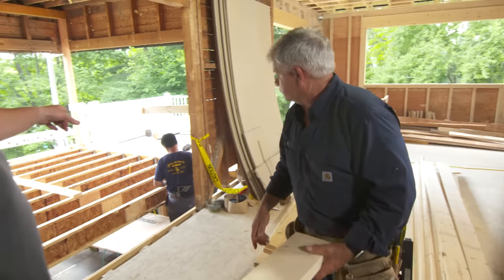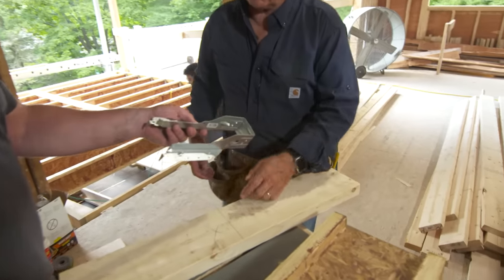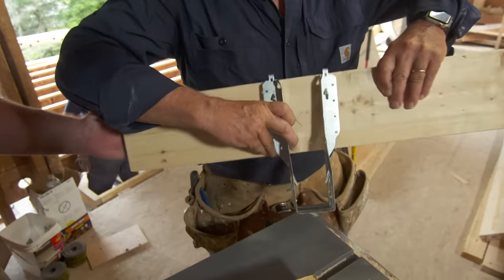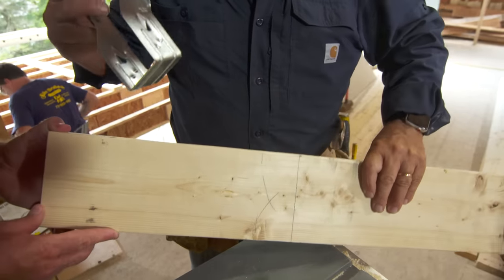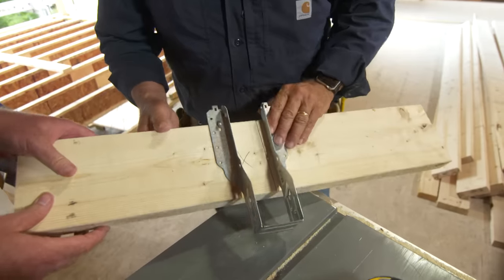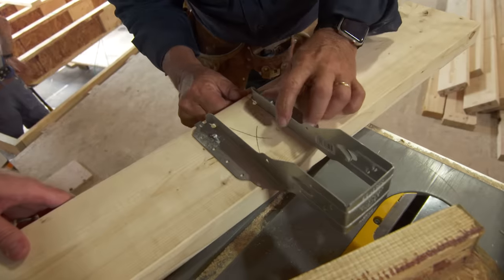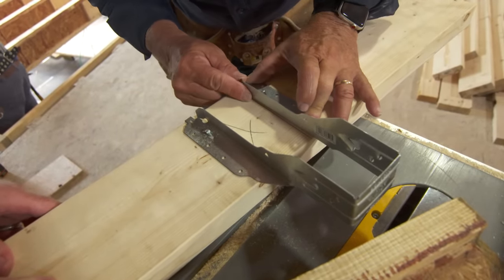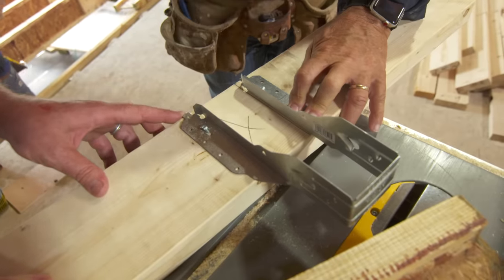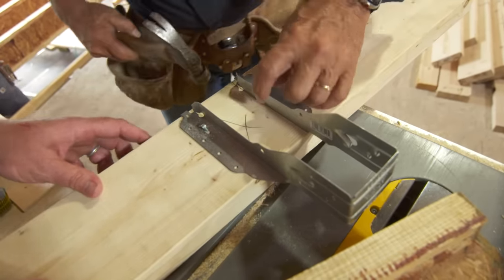We set it in hangers. As you can see over there, the hangers are going in. This hanger is a little different than a traditional one — it sits on top of the beam on the other side. If you're framing 16 inches on center, you mark it off, take the joist hanger, lay it down, and put it up tight on top of the beam right here, then line it up.